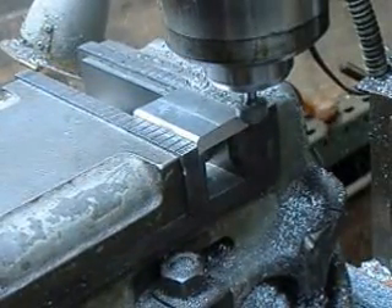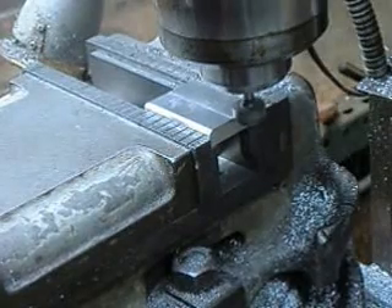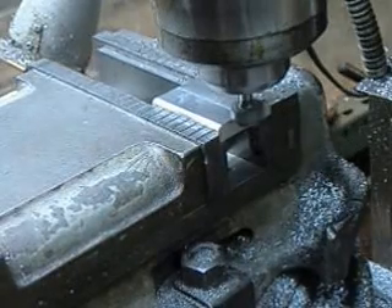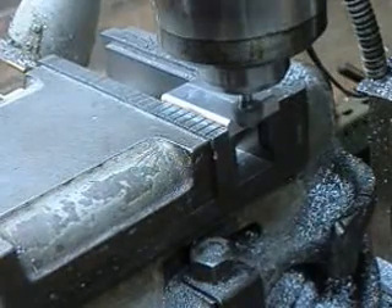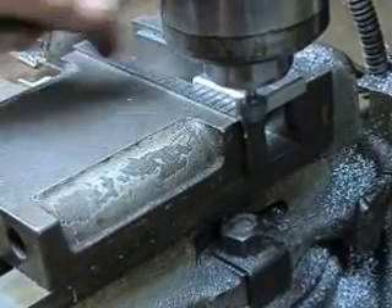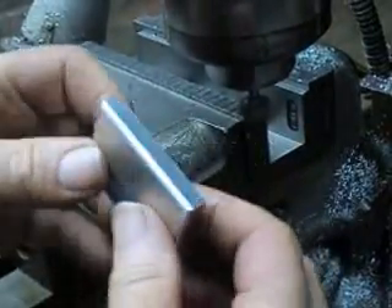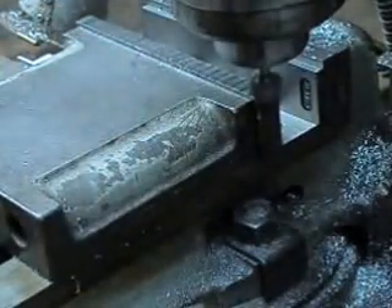Since this is really just a beauty cut, I don't have to worry too much about accuracy — all I have to worry about is having it be a really clean cut, and that means go slow, take it easy, and cut with the direction of travel. We're almost there, just a little bit more — there we go. Break the piece loose, pop it out, and we've got a nice radius all the way around. This basically is a spacer for the bearing blocks, to get the bearings to sit up high enough. That one's done.